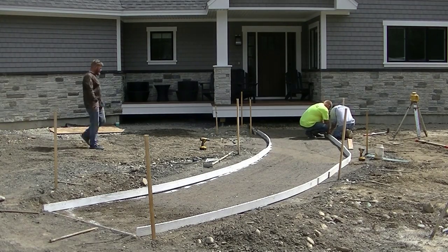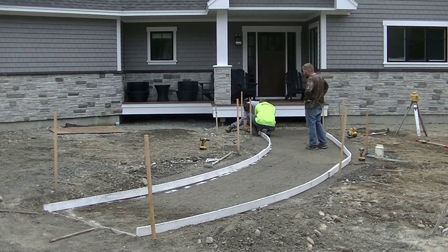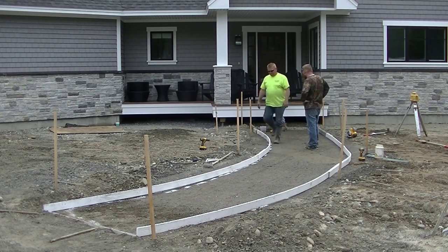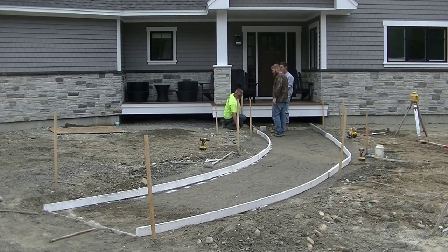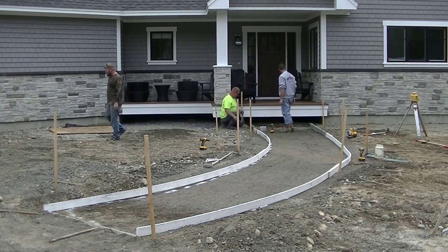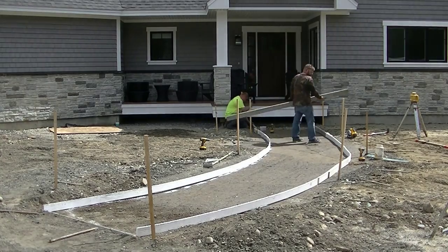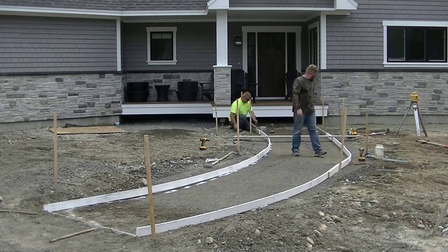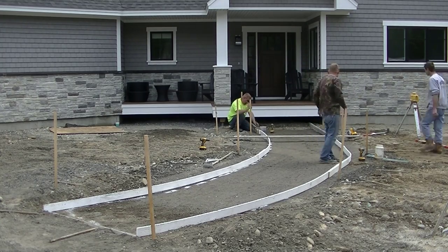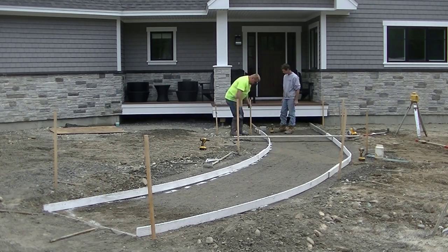You can see we had kind of a painted dotted line the homeowner put on the ground for us to go by — that's the rough sketch of this walkway and we're just going to mimic that with these forms. What we do is we get the form screwed together first. We use just a smaller piece of the form to screw the two long pieces together, and we use regular drywall screws — inch and a quarter drywall screws — to screw the smaller scab piece into the longer pieces so it gets everything screwed together nice.